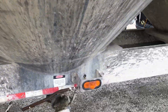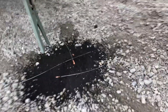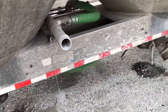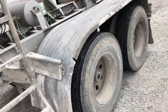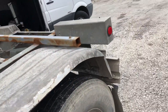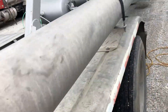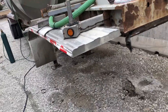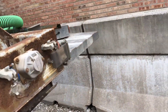I used the push-pull gun — here's the aftermath. This is an $1,800 push-pull gun and I consider myself a semi-skilled welder at least. By the time you run .035 wire and bend that push-pull gun three ways from Sunday with imperfect settings, always expect to go through a few tips on aluminum welding. Sometimes for a job like this a spool gun is just handier.